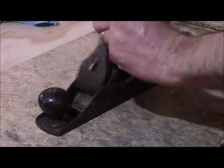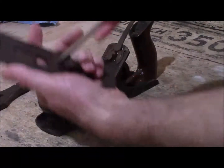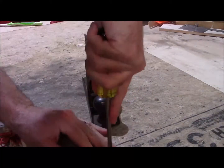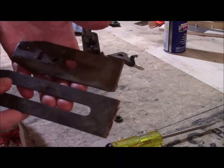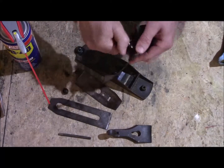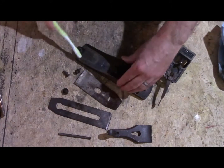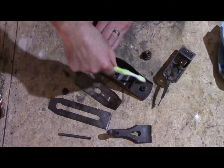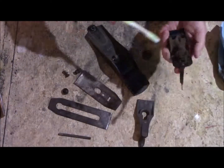The citric acid is going to dissolve the rust through a chemical reaction. I started by disassembling my hand planes, getting down to the metal parts only. Then I took the WD-40 and cleaned up the parts quite a bit, just to remove any barriers of grease, grime, or oil on the metal, because that would act as a barrier between the metal and the citric acid solution.